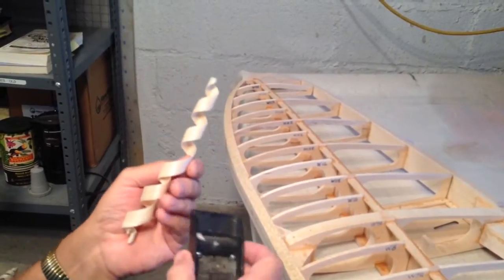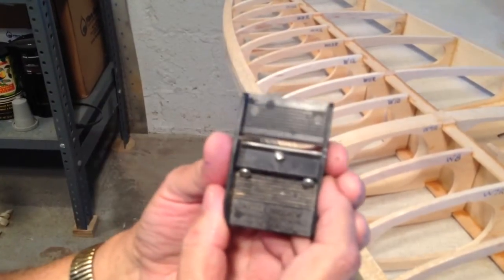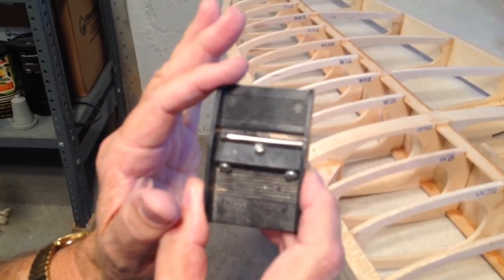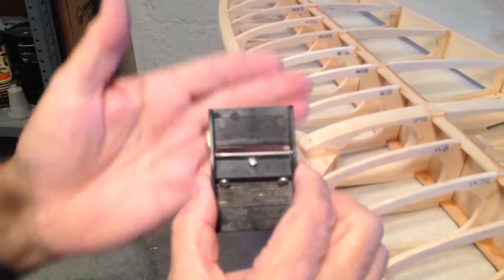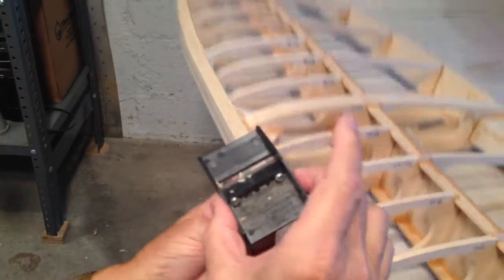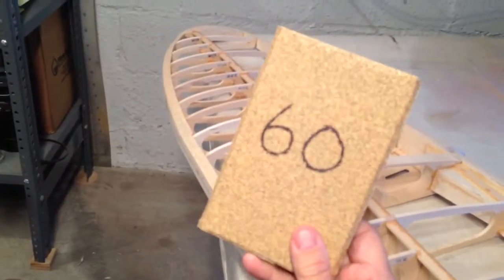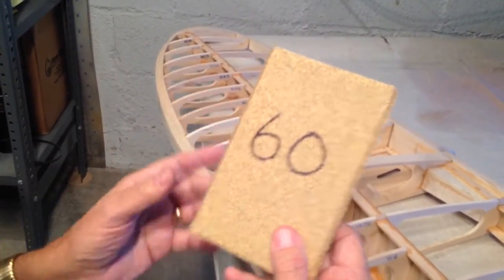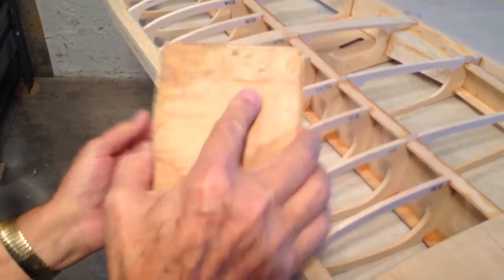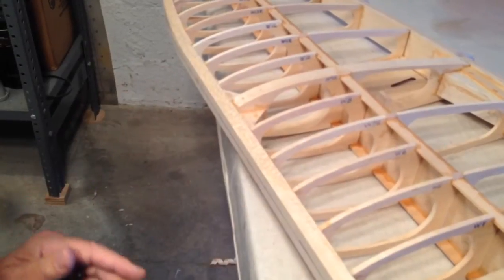About 12 swipes will take off a quarter of an inch, so it gets the job done pretty fast. The reason you really want — you need to own one of these, and get one if you don't have one — for shaping, is because it gives you so much control. There's just this blade right here, that's all there is to it, plus a flat surface. When you plane, you can see right where it's cutting. Contrast that to a sanding pad — when you put a sanding pad down you have far less control. A plane is faster; a pad is going to be smoother.